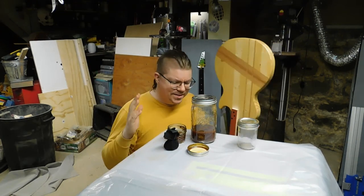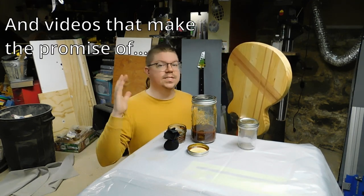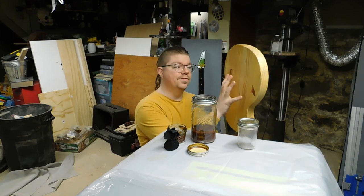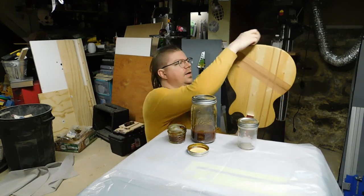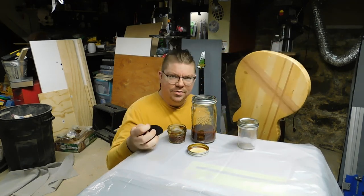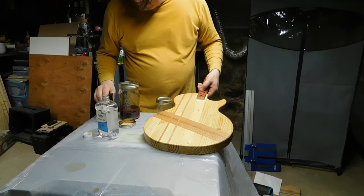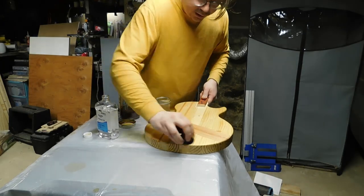One thing I learned from an earlier project was that I was overthinking it. You want to learn everything you can — there are hints, tips, tricks, and methods to how shellac works — but there is some point where if you're overthinking it you're going to mess it up in the other direction. I was putting all this time and effort into making the front and back perfect, and then what came out really nice and glassy was the edges where I just put it on and moved on. Those came out the nicest because on the main surfaces I was overworking it. A technique I'm going to try here is putting just a few drops of a non-drying oil on to help lubricate the pad and enable me to keep working a little more to polish up the shine.